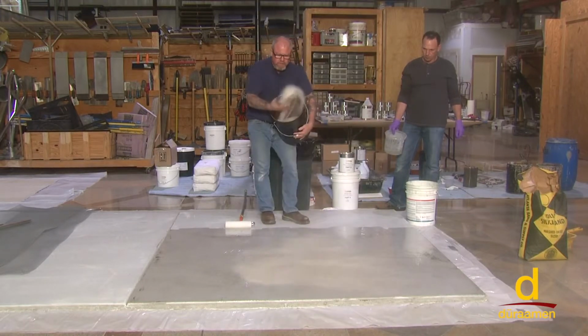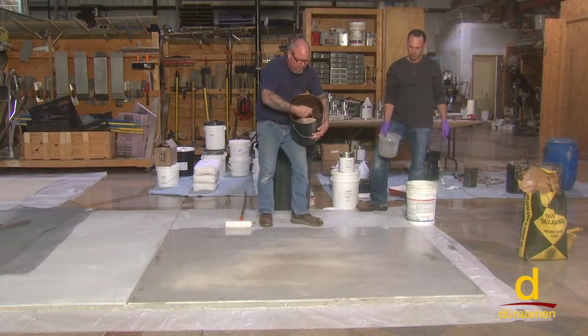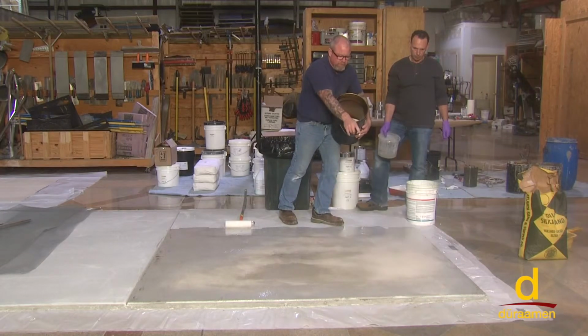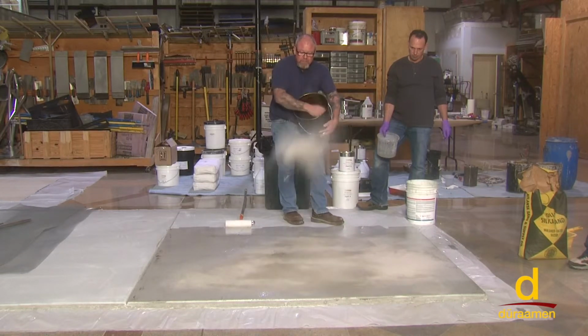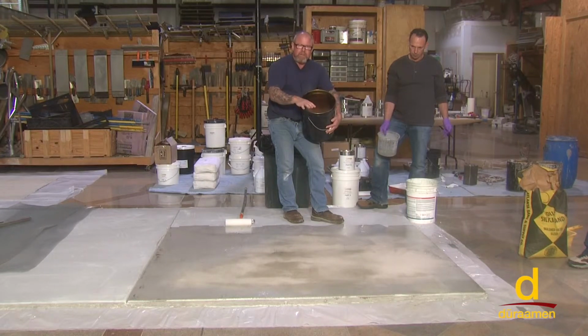So you'll notice how I'm throwing it down here. I'm not throwing it in a big clump, and so you'll see guys just come in here and keep throwing it. We use the term to refusal, like right there, for example. Even with that, if you're putting it at thicknesses that are thicker than, say, 8 mil, the sand will, over time, level out, and you'll see shiny spots.